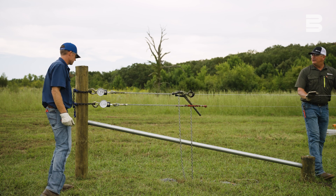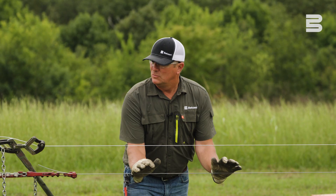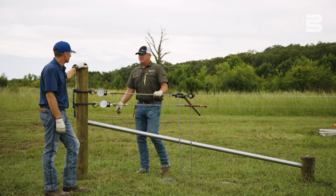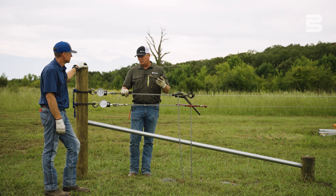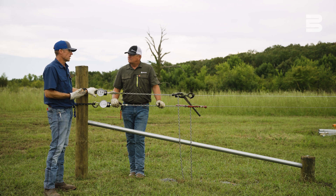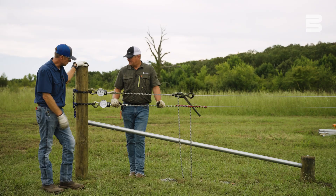Let's just put a little impact on that low carbon — you're below 300 pounds. Now let's put a little impact on that high tensile and see what happens. It came up maybe a hundred pounds but it's still staying exactly the same. I was able to stretch the low carbon without even pulling on the stretcher bar, just simply by putting replicated animal impact — and that would have been a small animal. That's really a good indicator of how this fence is going to hold up, because a lot of animals will come up, especially during dry seasons when grass gets low, and put pressure on that fence trying to reach through.